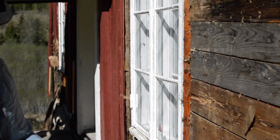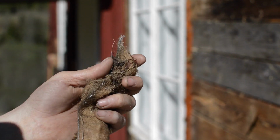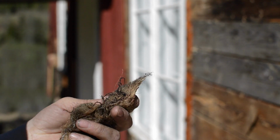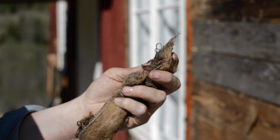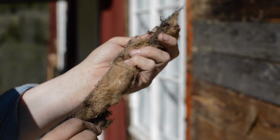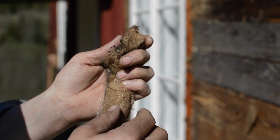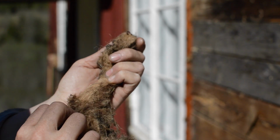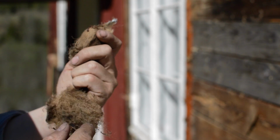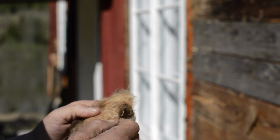And you can actually quite easily see the way condensation has worked here, or humidity. Oh, I don't know if that is focused or not. But everything that's kind of darker is where it's had humidity, and the lighter is where it hasn't. So here you can see quite clearly that the humidity stops within the first 3 or 4 millimeters. So that kind of proves that the condensation hasn't happened further into the construction. Again, just the very surface has some dark coloration. Inside it's the same colour as it was the day it went in.